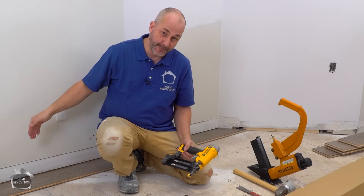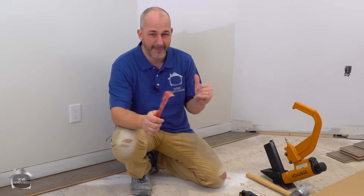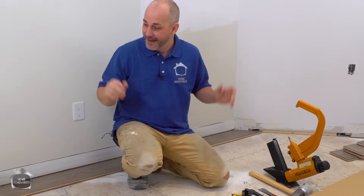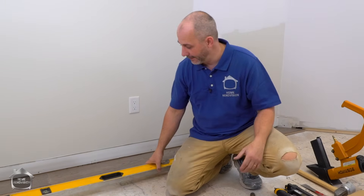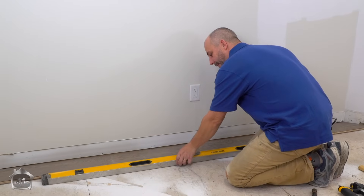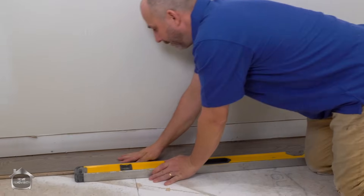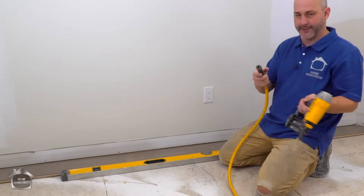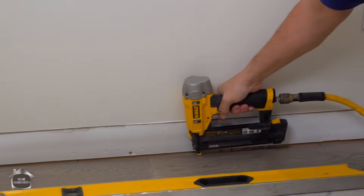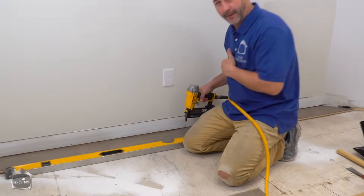We're only using the brad nailer at the beginning and end of the floor for surface nailing underneath where the baseboards will be installed. You'll also possibly need a pry bar to help manipulate and put pressure to close joints — five bucks and everybody should own one. My trick for starting the floor installation is to cut the first few pieces for the full length of the room, lay them in position, and use a level over the joints to make sure all gaps are closed before surface nailing. Then hook up your compressor and surface nail every three to four inches along the whole starter strip.